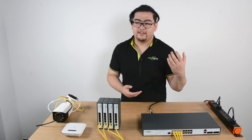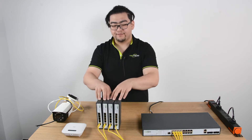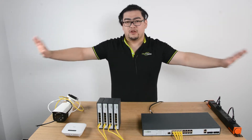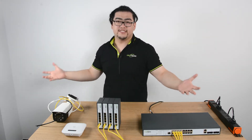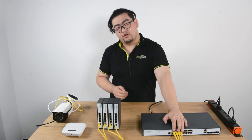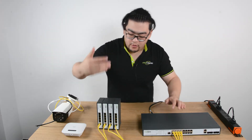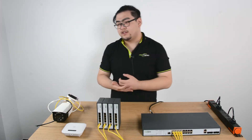We're going to use 4 of the high-powered ports to supply power and data to these 4 switches. And these 4 can reach up to 100 meters in all directions and provide power and data to multiple devices. So by only taking 4 ports of the 16-port PoE switch, we can connect up to 16 IP devices. Really convenient.